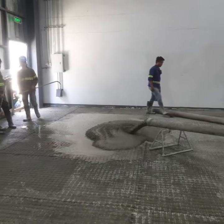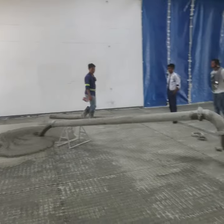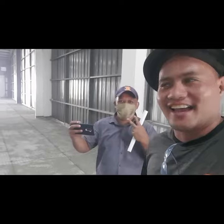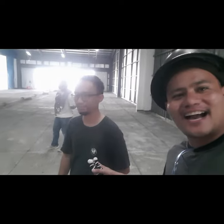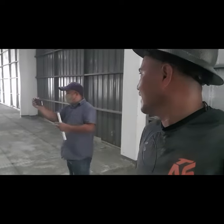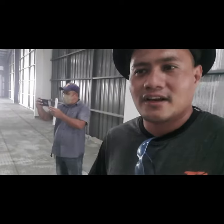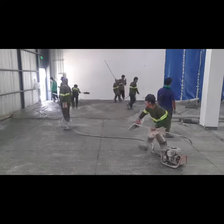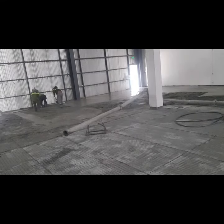And it's the concrete pouring time. I'm with architect Landell and with my guy here, Rosbear. Behind us here, we start pouring in the concrete. So we've used a 3000 PSI design for 14 days curing concrete. Let's go time lapse and have a look at how we are able to achieve a flat floor.